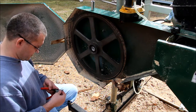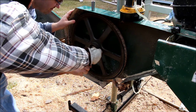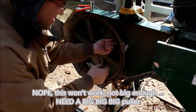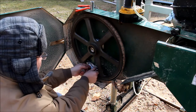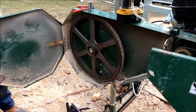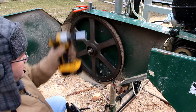I've got a set of snap ring pliers here that are indeed reversible, so let's remove the snap ring. We've got some of it out there. I've got my bearing puller set — the big one. The objective here is to push the spindle back and pull the bearing forward. Unfortunately, I don't have a puller that works, so let's try this the old-fashioned way with PB blaster on there.